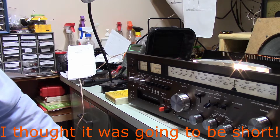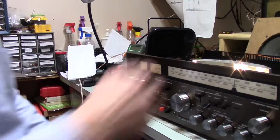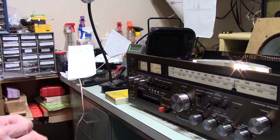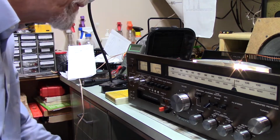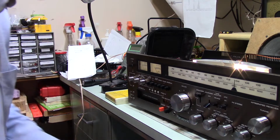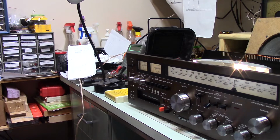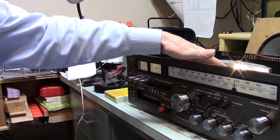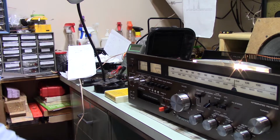I put out this short video just to show somebody what they might be dealing with when their stereo starts doing the distorted gargling sound. This is an older one. It's an amplifier chip, an STK-040, which I guess is probably fairly common. I also know that some of those will go bad, which I was really hoping this one hadn't. And I found out very quickly by just moving the heatsink that that wasn't the problem with this. It was the solder joints when I actually went and looked. So just a little quick educational thing to help people when they encounter this kind of a problem.